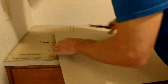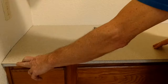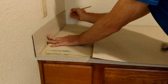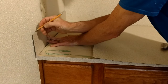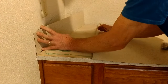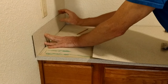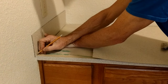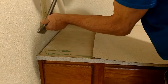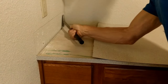That's a pretty good fit. If using a backsplash, take a pencil and the backsplash piece and mark it just behind the top edge, then bend it and pull that back to mark the front edge — that way you know the perimeter of your backsplash. I take my four-inch razor blade scraper and scrape down those high spots — they are mountains in the scale of laminate, which is less than a sixteenth of an inch. Do the same thing with the back wall as well.